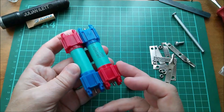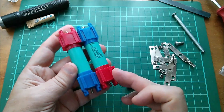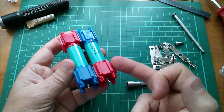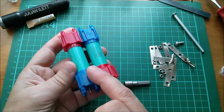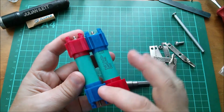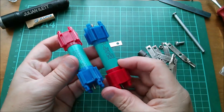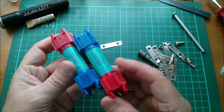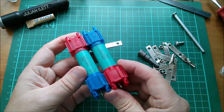One thing I learned when I made the battery last time is that putting dovetails opposite dovetails is a bad idea. On one end of the cell, you want one of the connector types — like this is the dovetail — and directly opposite you want the exact opposite. So here, dovetail. No, that's slightly wrong, because I've got a dovetail opposite a dovetail. I'm going to have to take that back off. Yes, after playing around with these things for a while, you start to get your head around how you need to position the dovetails and the slots in order to make this truly modular.